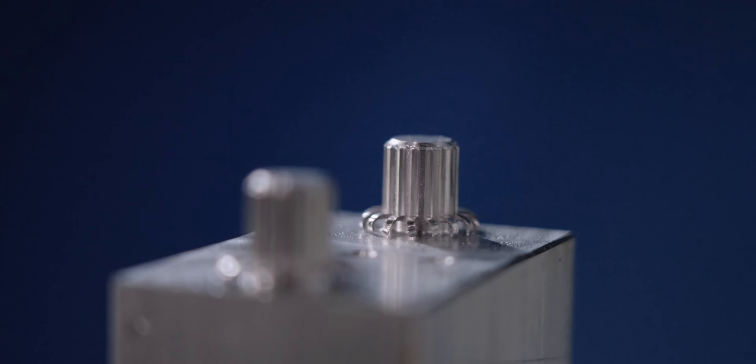As you can see here, we rolled up some burrs on this DVF 5000, but that's because we didn't have an undercut. Not too big of a deal, but here we're going to have to go back in and rerun our tool and clean it up.